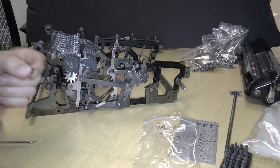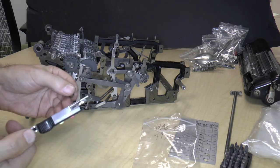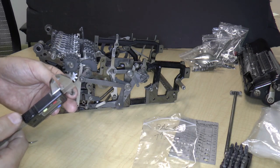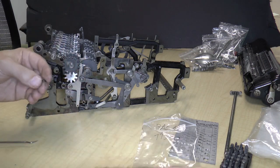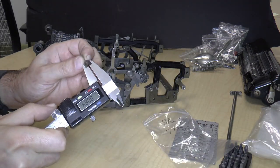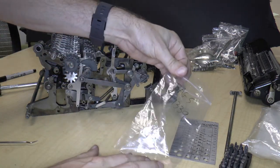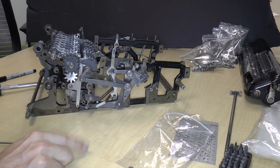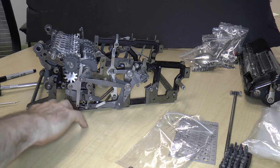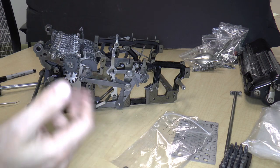With washers, I don't know how many I'm going to pull off this thing, so I'm going to measure the washer: it is 0.034 inches thick, outer diameter 0.315, and inner diameter 0.153. And just for completeness, I'll take the retaining wire clip and measure its wire diameter, which is 0.037. What I might do is replace that with a modern C-clip - it's a little bit anachronistic, but I think it's a better thing to do.